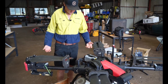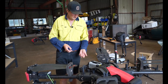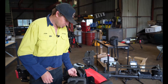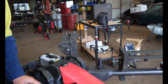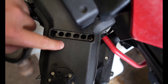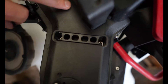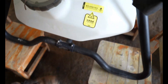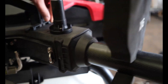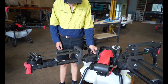The pumps are all peristaltic so you don't need to worry about impellers — we haven't had any pump issues yet. There is a filter inside the actual tank that you can take out and clean. Also, on the arms where they connect into the aircraft, there are rubber mounts and main bolts holding the arms in — it's good to check those bolts are still tight every 100 to a few hundred hectares, since things do vibrate.